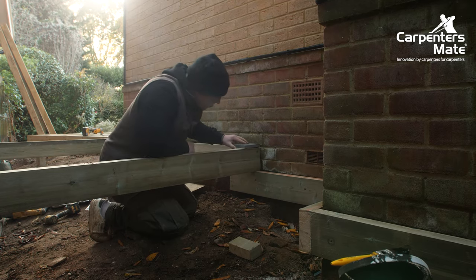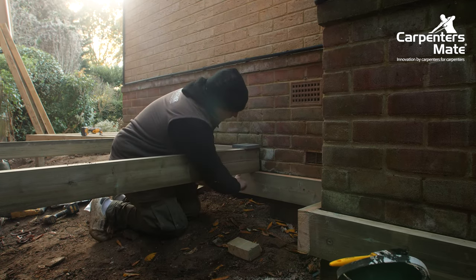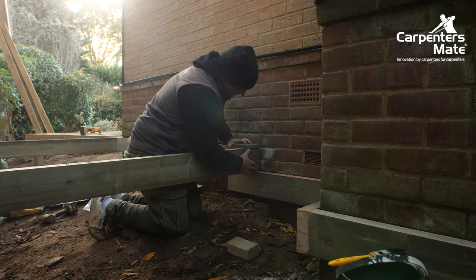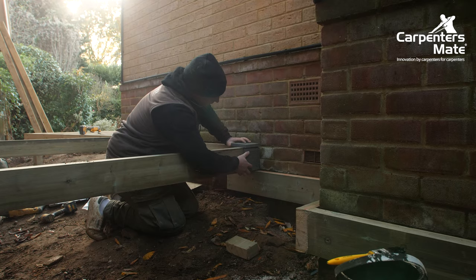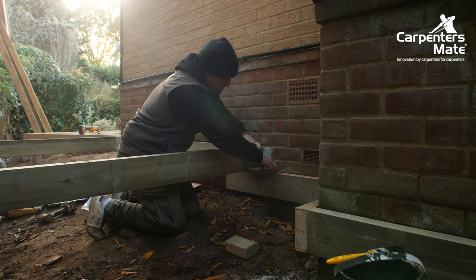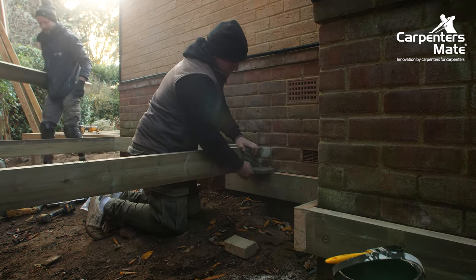On this particular deck we're going to have a step down here, so we're using 150mm timber as our frame. We've double-joisted this part — we can use one as a fascia board to tuck underneath and there's still plenty of flexibility. We can put a 3, 4, or 5mm join on here to get our step, and then the next board will come in up against this one, giving us a 145 to 150mm riser, which is a nice safe step height.